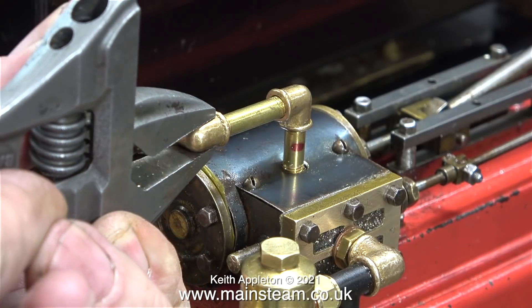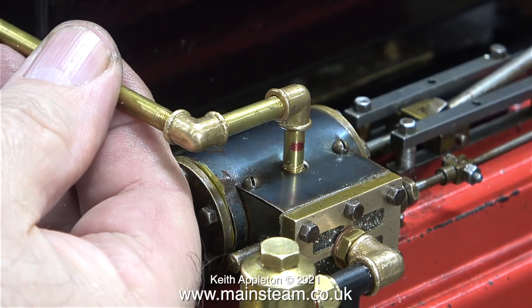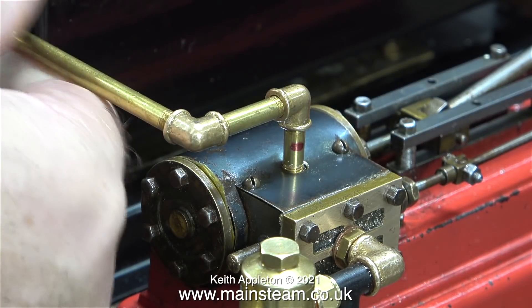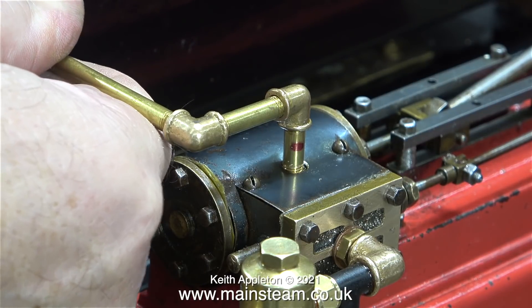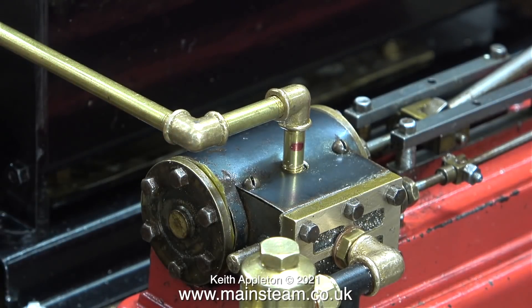My friend Dennis will not be aware of what's going to happen when he first opens the steam tap to let steam to the cylinder. The steam will condense immediately to quite a lot of water. There aren't any drain cocks fitted to the engine, so all the condensate will go up the exhaust pipe and up the chimney — but then it will run back down the chimney onto the baseboard and make a mess, or even put the fire out on the ceramic burner. And as the condensed steam also contains steam oil, the heat of the boiler is very likely to make a sound like fish frying in a chip shop.